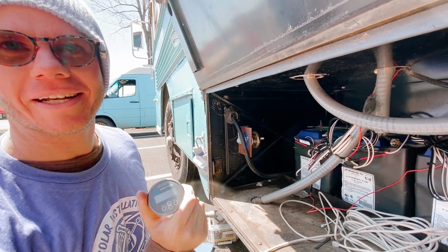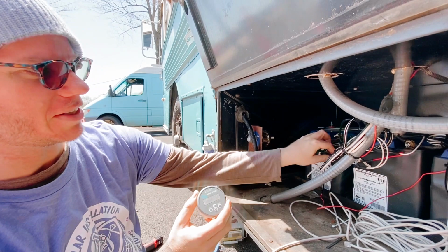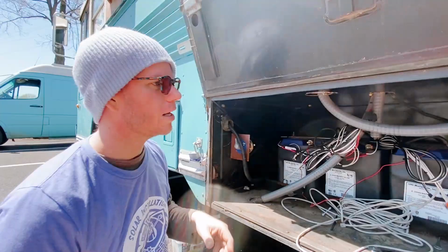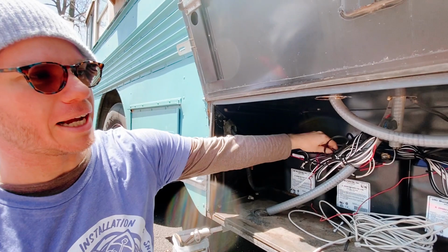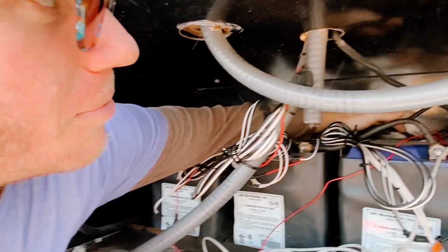But yeah, so when installed, he installed them pre the shunt, just because of time-wise, we just wanted them in there quick. And so it was giving an inaccurate reading to this guy, so we've disconnected the battery warmer since we're going into spring and summer now. And we just went through and double-checked the tightness of these and found new opportunities for growth. For example, we're gonna swap out one of these cables at a later date. It's a little undersized, as well as a fuse being oversized.